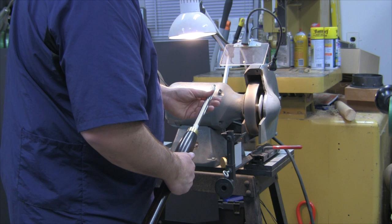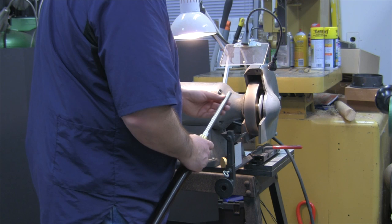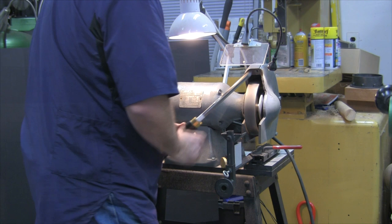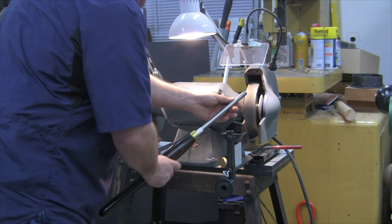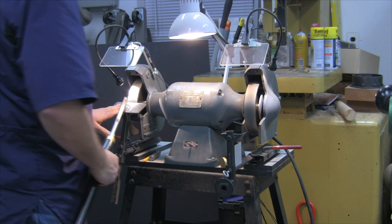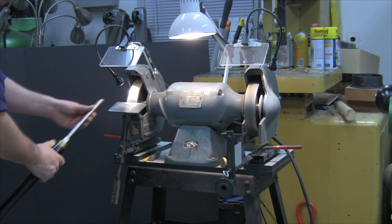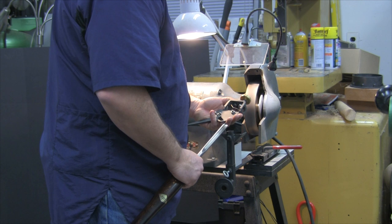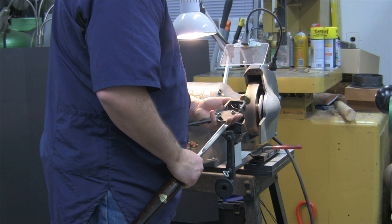All right, let's get a closer look. The motion here on this tool — the swept-back wings — it's not something that you can do in a single motion. You need to articulate. It's a move from moving the handle from left to right with a rolling action. Some people do it off the tool rest using that as a reference, but it's just not so easy to do. The one-way Wolverine system allows you to do that very, very easily.